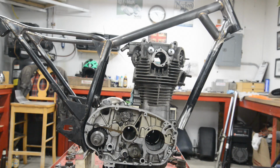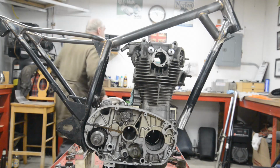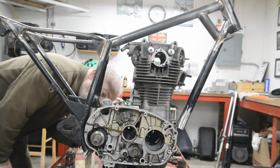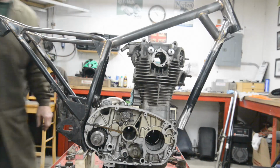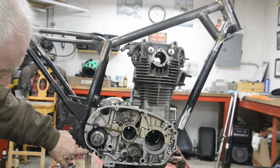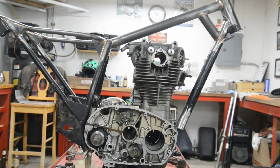But it didn't go in quite as easily as it looked as if it might, but it's in nonetheless. We've got space. I've got a long bolt, and I've just got some 10mm rod to make the bottom engine mounting bolt out. But if I put this through there, you can see I can make a nice engine mounting just on the end of there for that. So I can do that both sides. A couple of spaces in, that'll be perfect.